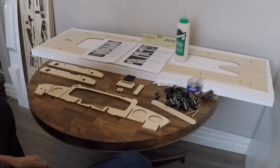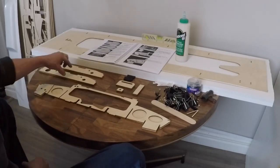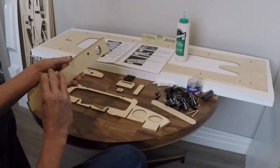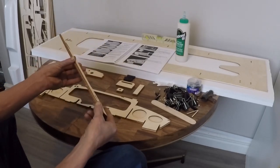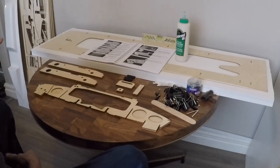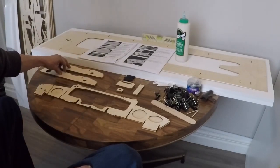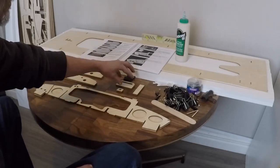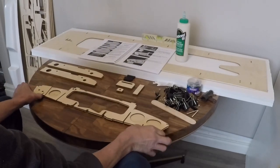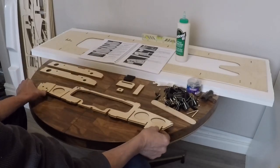Today we are moving on to step number two in the manual and we are going to do our laminates. Our laminates are basically pieces of wood that we received that were one-eighth inch thick in the sheets that we have to glue together and clamp in order to make them one quarter of an inch thick. We have some simple pieces that we need to do today which are two engine rails — all four pieces when you pop them out of the wood. We have three pieces for our exhaust mount and we also have bulkhead number three which is a major structure bulkhead in the frame of the boat that we have to laminate together.